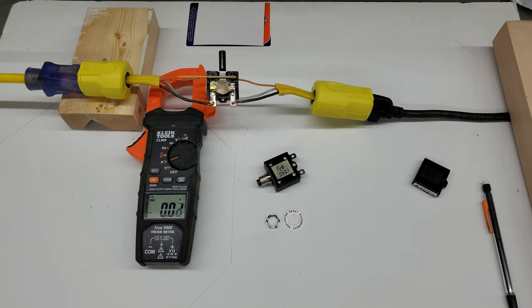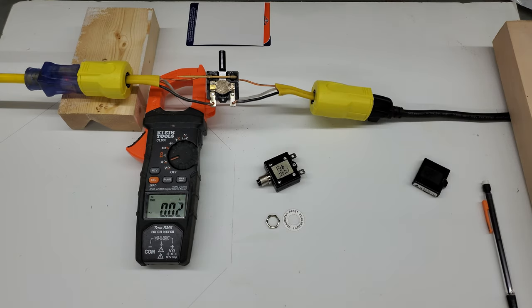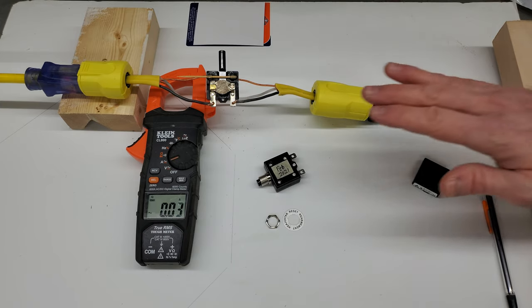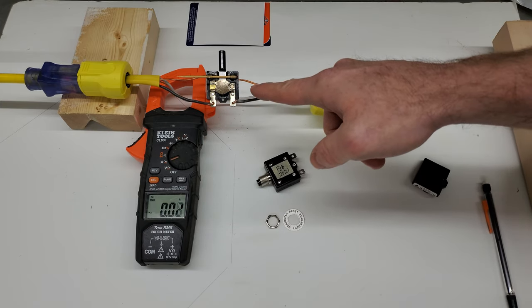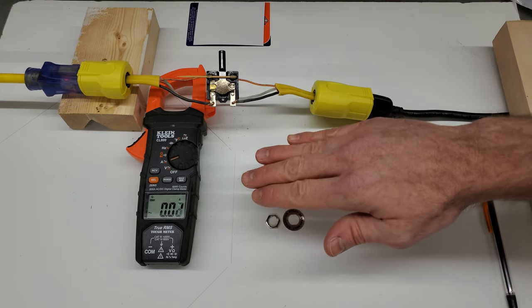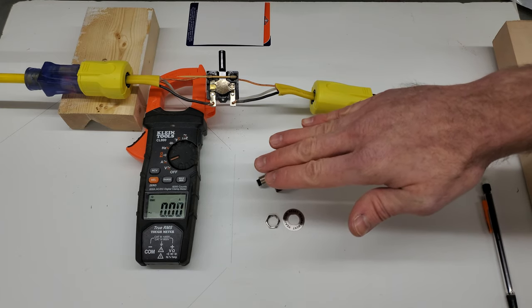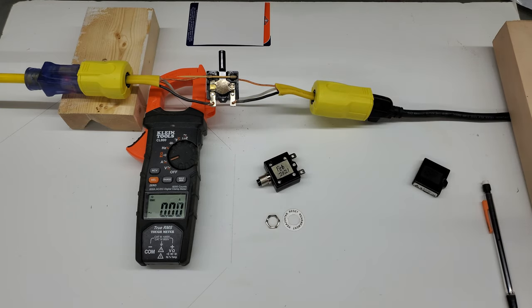Well, that wasn't quite as hard as I thought. Now, what happened was that the board was coming out of the far end of the planer. Sorry I didn't have two cameras going, but I figured this part was the more important. As the weight of the board was dropping down, it was picking up the tail end of the board into the snipe area, and that was causing a little higher draw. So this probably bumped up a little bit right at the end.